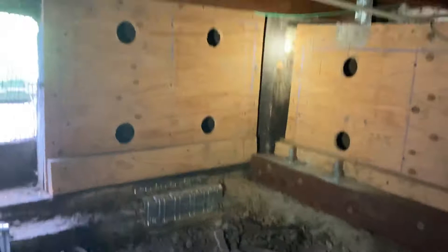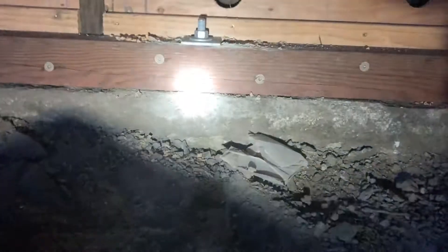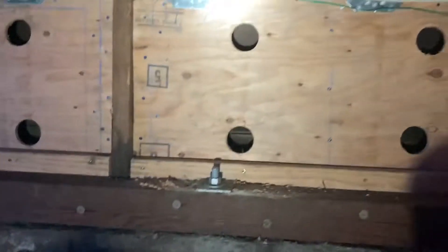What that does is like a bunch of dominoes — it puts a piece of wood on the face of the studs so they can no longer tip over because they're nailed up. That keeps these corners of the house from failure due to cripple wall failure. These are the shear panels of plywood added to the cripple walls. Here's the floor, there's the ground, this is the crawl space — what you don't want is this floor to come down two feet because the whole wall collapses.